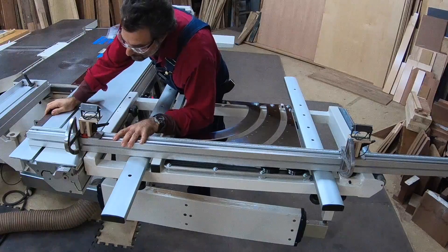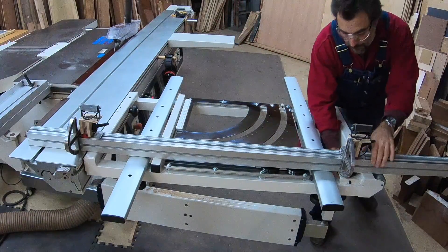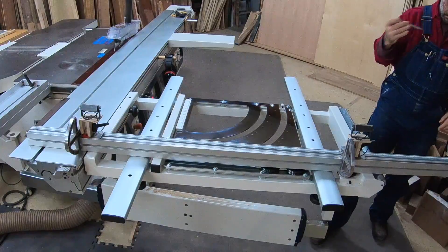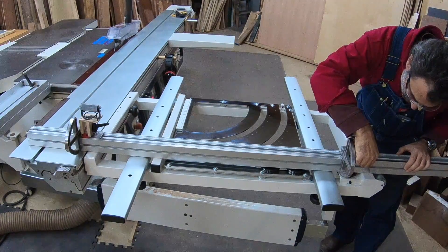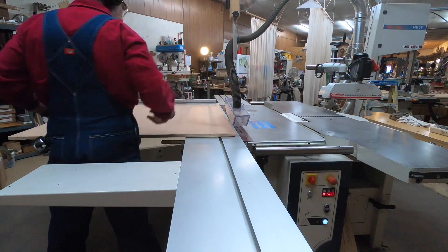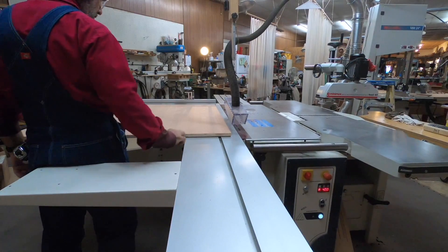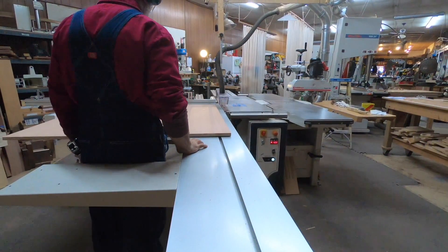I'm going to take out my grandfather's trusty steel framing square — it's the only one in his shop that didn't have 'NFG' written on it, so that's the one I'm going with. I've used that square for years and put it up against an engineer's square and it's dead on. I set the squaring fence to the edge of the slider, not the blade group.